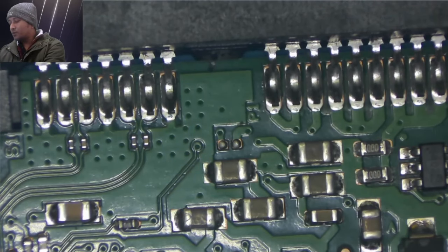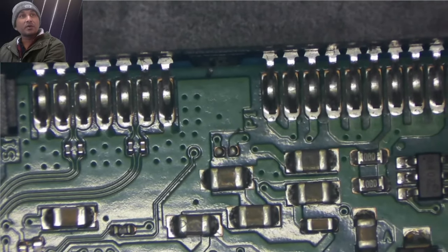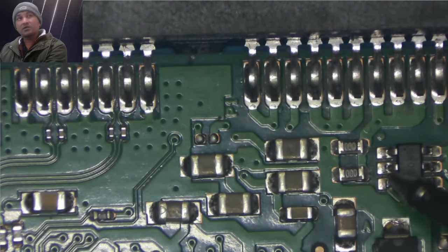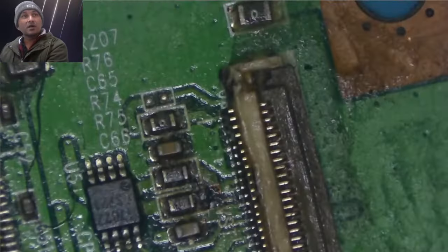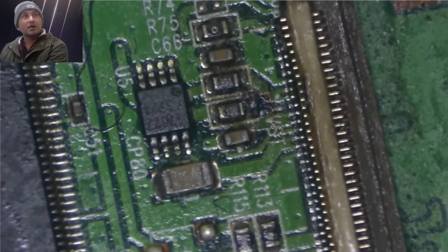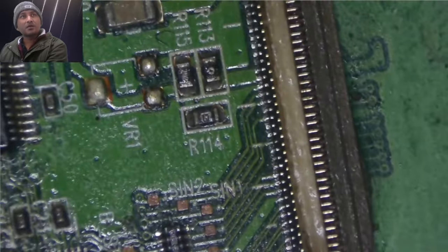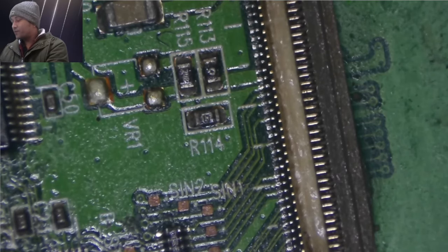Before we go to remove and replace them, let me show you. They are zero ohm resistors. That time I couldn't show you guys. You can see on my microscope window now, it's 000. So normally zero ohm resistors are like that. It can be a single zero or 000 or double, doesn't matter. They are zero ohm resistors. And the ones that I'm going to replace them with are this one, the first one, and that's the second one. So let's remove all four of them and then see if this hard drive can work again.